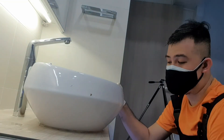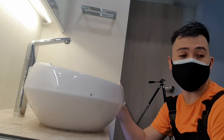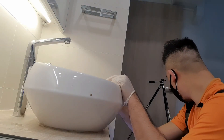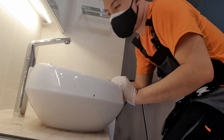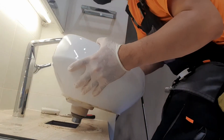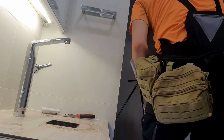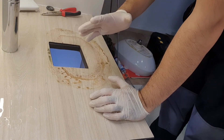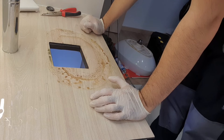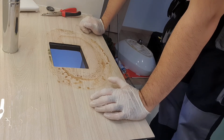So the plumbing has been disconnected. I'm going to be taking off the sink, flip it around and put it somewhere safe. Right now we have all the mould and stuff that has grown over the ages. We've got to clean all this up and then we'll apply a new bead of silicone and put the sink back together again.